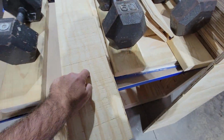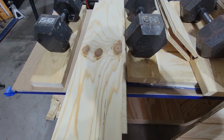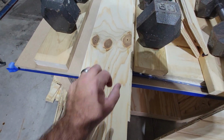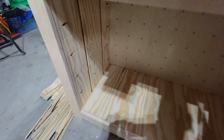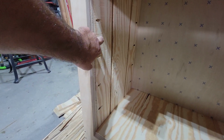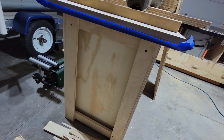You can see that the surface of this is really rough, which isn't a good thing. So I'll usually sand that surface to 80 grit just to get the burrs and stuff knocked down on it. But the inside, it's knotted, and a lot of times you'll come across these splits. They're kind of unavoidable with how low quality this stuff is. But you just sand it and finish it. This is workshop furniture. It's not fine furniture. You can see I've even used it here on this inside panel. Like I said, when you sand it to 80 grit, it's not terrible. You still have the grit marks from the planer or whatever the heck they used. Chainsaw, I'm not sure. Beaver. But then on the outside, you sand it to a nice finish. Blends right into everything.